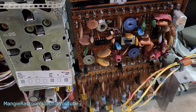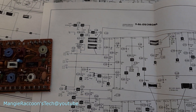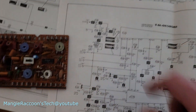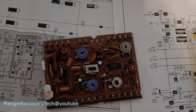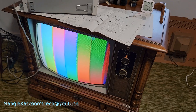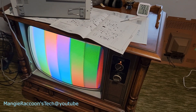There are ICs on it. I'll get some voltage measurements now that this thing is working right. The resistors and capacitors have checked out fine. The only thing that's not checking out is getting voltages in but not out on this IC chip. I looked up this part number - it's 21-69 - and I actually have a 21-69. I can't believe I actually have the chip for this television. I'm going to try to desolder that chip and put that in there. It's acting a little different now but it's still not locking in or working correctly. I'm not sure if something outside of that chroma board is bad or if there's something on the board I missed.